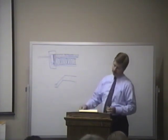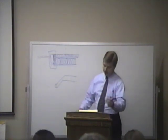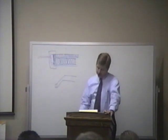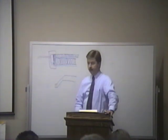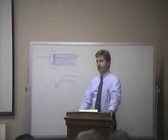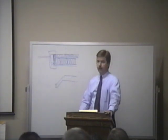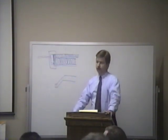I want to say a couple other things on that too. On page 79, I talk about the air changes per hour. In a new typical building, your infiltration rates will be in a range of 3/4 air changes to 2.5 per hour. Now, the city of Enid administration building, I don't even want to guess what their air changes per hour were with the way that thing was poorly put together. But the more loose the structure's built, the more impact it's going to have on the energy consumption.